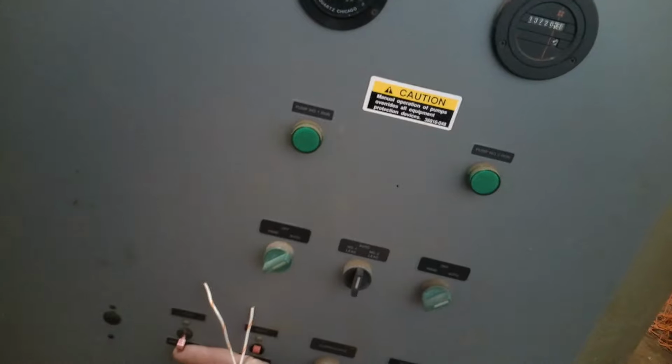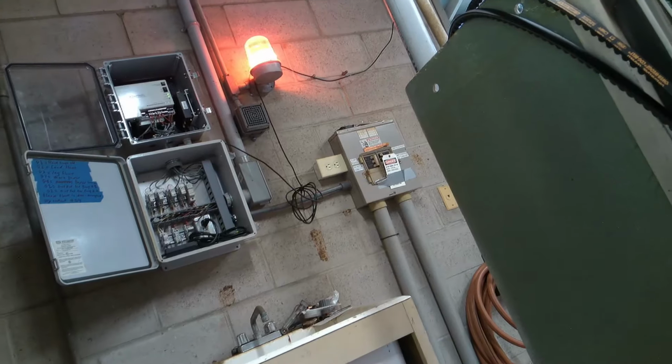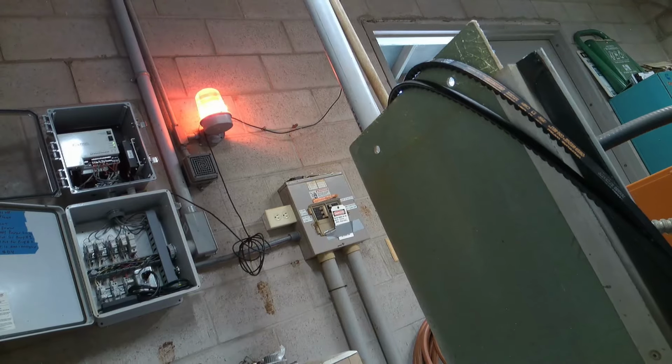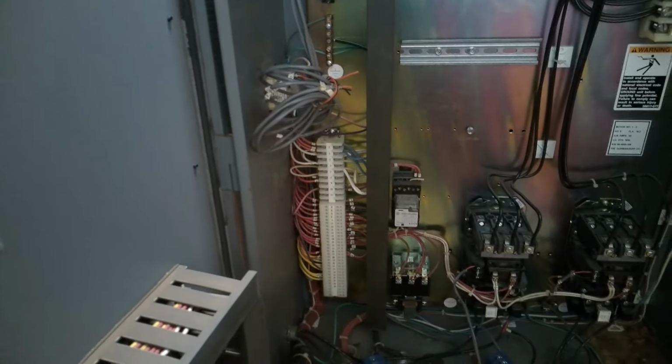But yeah, it's kind of strange. How come only now it's doing that? Because I remember, Wes was there when you did that alarm call. Not alarm call, but the warning call. And like I said, all this time when I used to change floats or trigger the float, you could see it always triggered the lag float and it caused an alarm. Now it's not doing that. Now you've got to wait for the high to call out an alarm. Yep, that's what I'm seeing. Yeah, that's kind of strange.